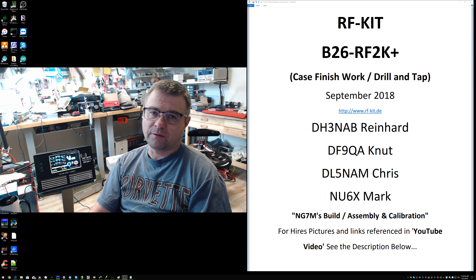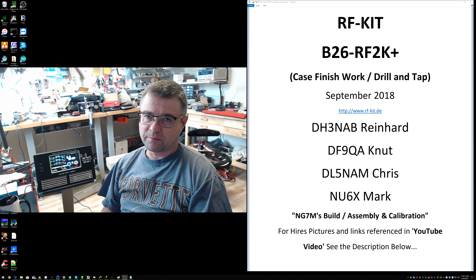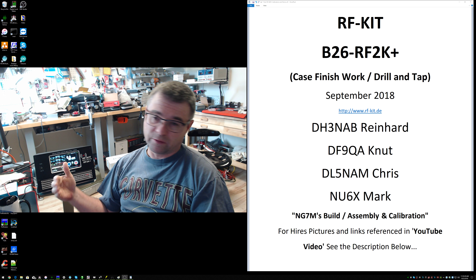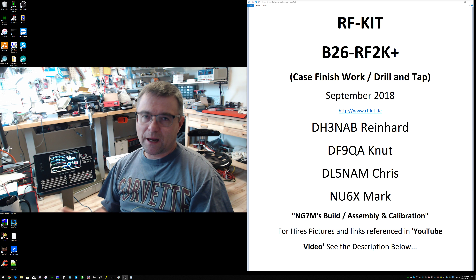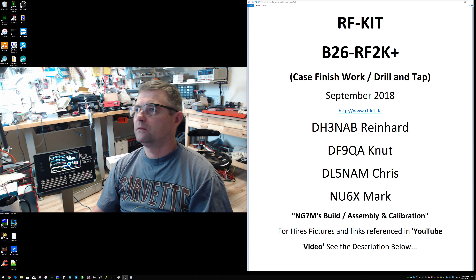You could drill the case and tap the holes and use different hardware. This is the way I did it — I wanted to be as professional as I could. I've posted pictures on the forum already. I wanted to go through some of the other details so guys who have ordered their amplifier kit can see exactly how I did it. I'll post some links in the description to things I bought to complete the finish work, and touch on things which do not come in the kit. You'll get good pictures of the powder work, and how I drilled, tapped, and did countersinks on the case cover and front panel.